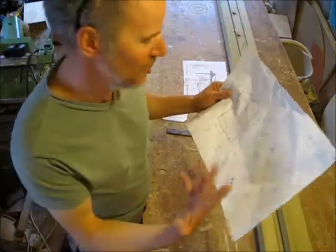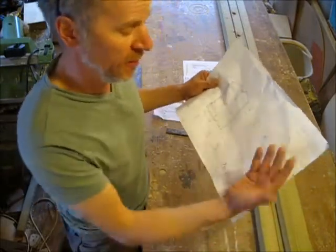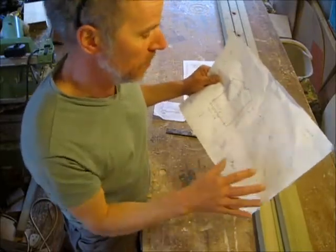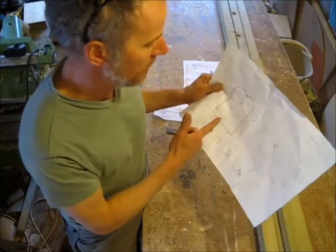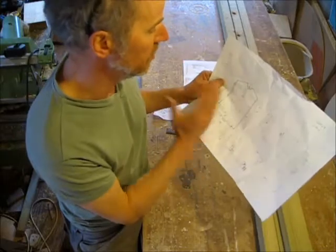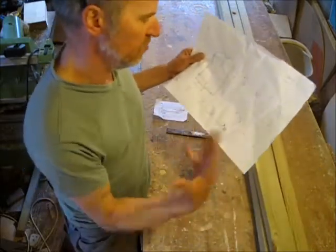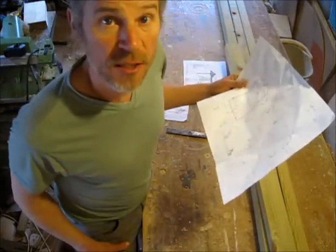Let's get this mighty door built - it's pretty big and it's going to be quite heavy, plus it's going to have stuff in there. It's going to have flip-down tables so you've got your tools and bits and can work - that's the idea of it. I've got some big hinges coming, a heavy duty wheel for the other end to keep the whole thing stable so it can roll out. I'm going to do lots of halving joints so this thing is nice and solid, glued and screwed together. Lots of marking out and cutting.